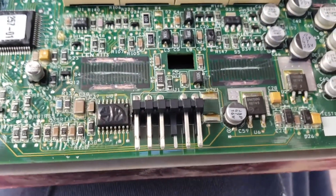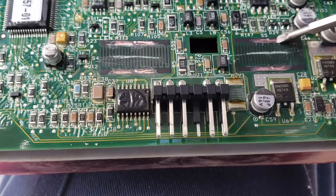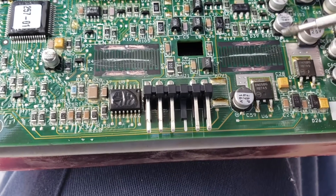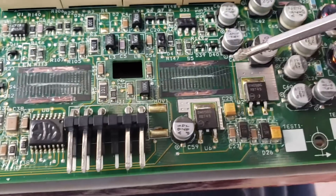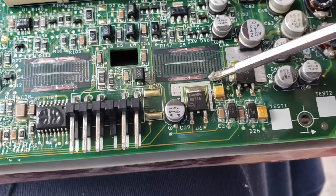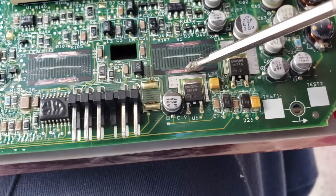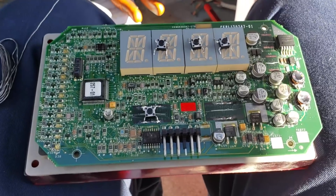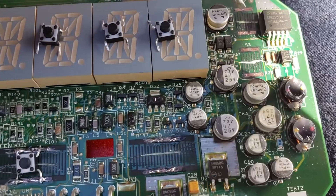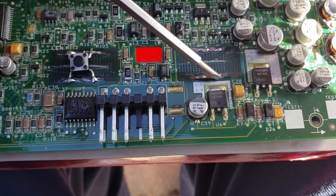So this is how I've been prepping the board — I've been changing how I do this with each one. I scratch off the coating to get down to the bare copper, and then I can flow some solder on there. Each one of these little black lines: one line goes up, the next one comes from up here and goes down, the next one goes up from here down. When you push the little button contacts, it's bridging these across — basically shorting this terminal to this terminal. After I've scratched down to the bare copper, I then tin the copper with some solder.